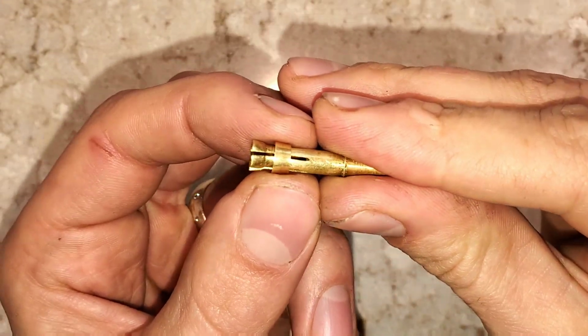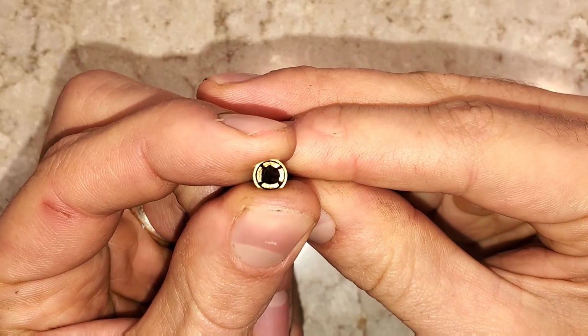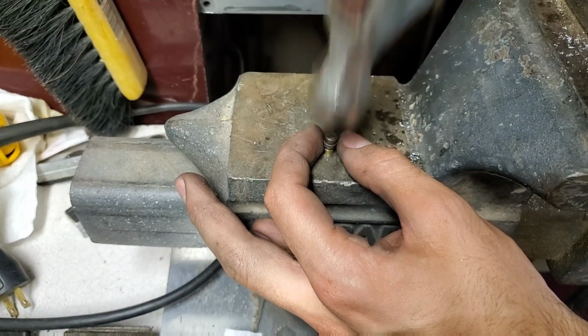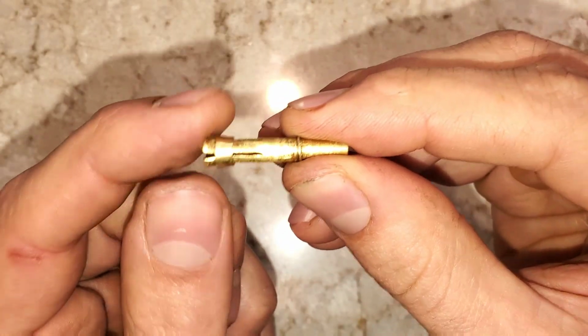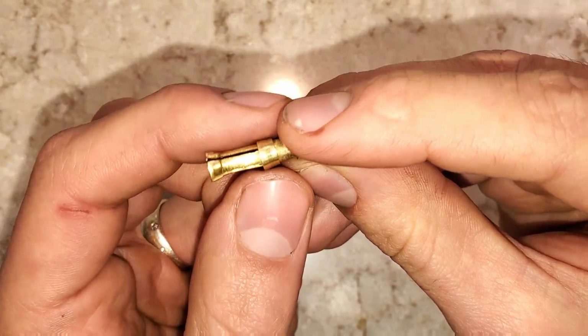Another important component is this clutch ring. This is the ring that's pressed forward by the spring, and when it is, it closes up the clutch that holds onto the eraser. I originally thought that the inside needed to be tapered to match the taper of the clutch. It's important that it's held here by friction, but that taper made things worse for me, so I realized no taper on the inside is better than having a taper.